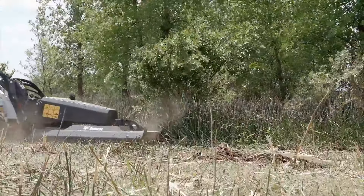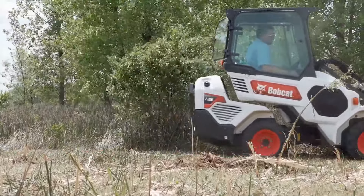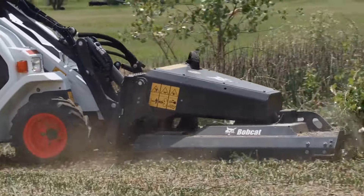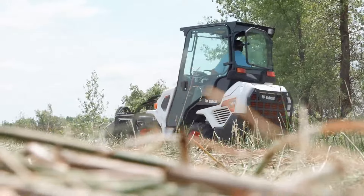The unit is made with a direct drive motor which goes down to what we call a stump jumper, where the blades are connected. As you're following the ground and things are moving, the stump jumper allows the attachment to go up over certain contours and not catch, allowing the blades to give you a nice level cut.